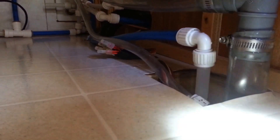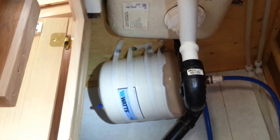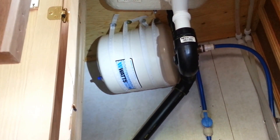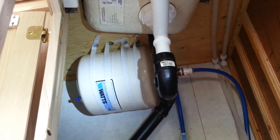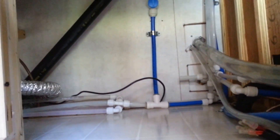What I felt I needed to do was put the pressure tank directly after the pump, which is the way you typically install something like this. Being that the pump comes up into the middle of the floor here, I didn't want to put a pressure tank right over here — I wanted to put it up there in some poorly used space. So I strapped it up in place. I was going to make a wooden cradle for it, but I decided just to use four pieces of strap. I think it's well secured, and if I don't feel comfortable about it someday I'll build a wooden cradle.